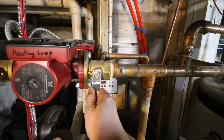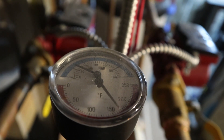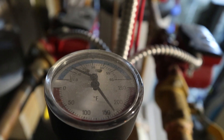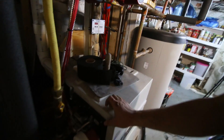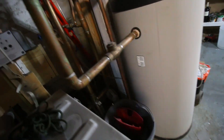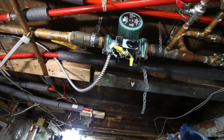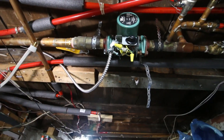Turning all the valves back on. Make sure that you re-pressurize your system up to about 12 PSI, or whatever the system spec is supposed to be. You want to make sure you're running with the proper PSI or else you get cavitation in the impellers of the circulator pumps, which is not good — it will wear out the pump prematurely. Fire the boiler back on. I know I have power to it and it seems to be working, so the cycle on first works. Now we'll wait for the boiler to get up to full temperature until it starts circulating water for heat.